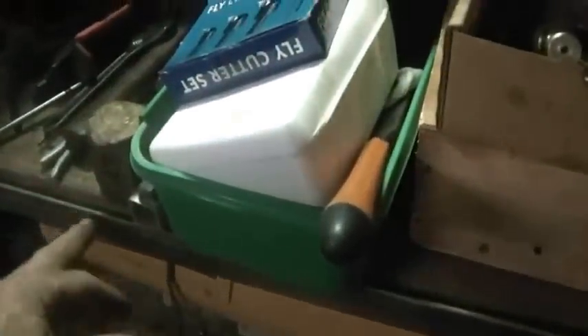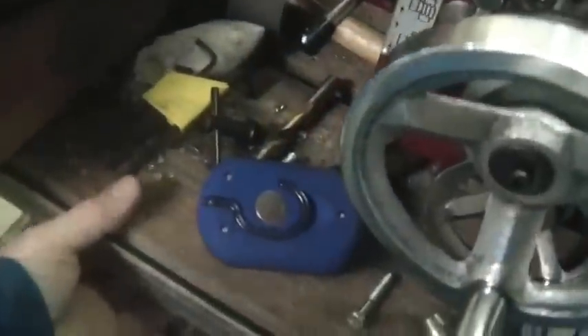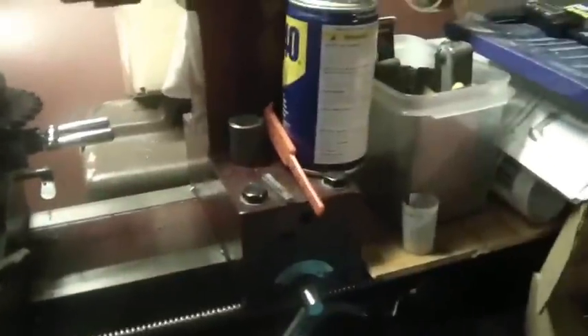What I did was build the table first. Then my son and one of his strong friends basically had one side and I had the light side — we had to pick it up and put it on the bench. After that, the bench was doing the twist and I was afraid it was going to torque and break, so I added extra support legs specifically on that side. That got rid of the torque and gave me enough strength to keep it proper. It's a one-inch piece of plywood on top of bed frame. It rocks a little but it doesn't torque anymore.